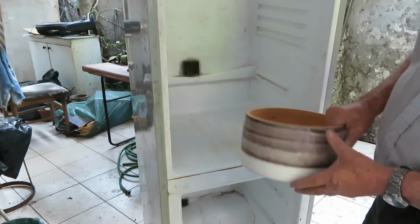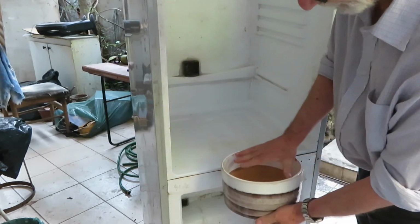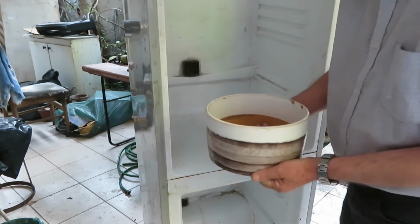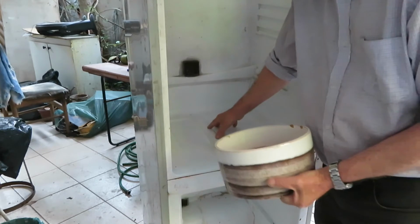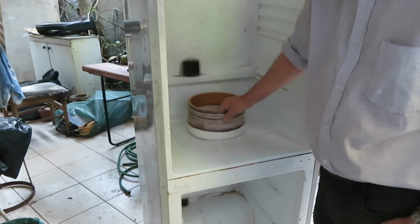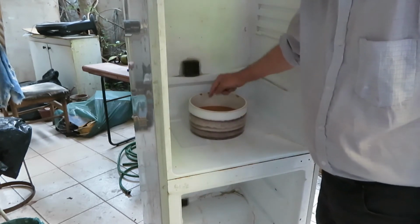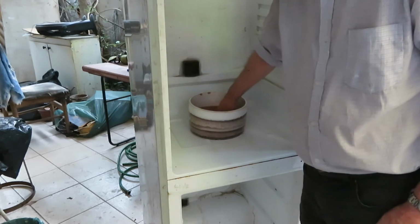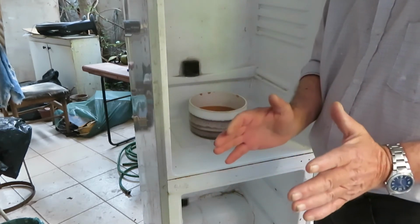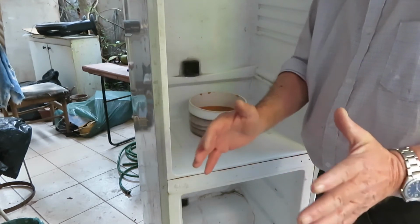So I have to be very careful how I position this and how I do the cut. The same, this side will be the wider part of the bowl, and the other side will be the less wide part. So I have to mark here both the wider diameter, but also the smaller diameter. And when I start cutting, I'm going to start cutting in the smaller diameter, so that if I make any mistake, I can fix that afterwards, when I'm opening it up to the wider hole.